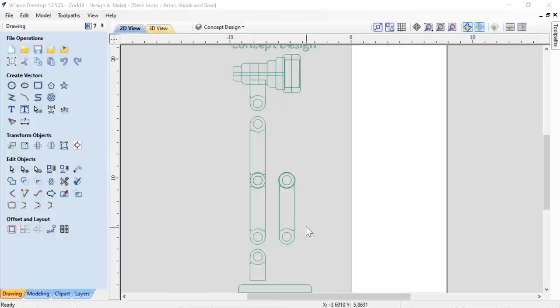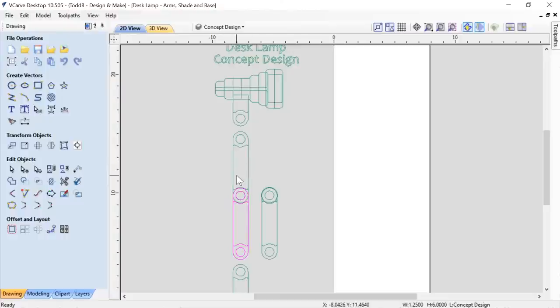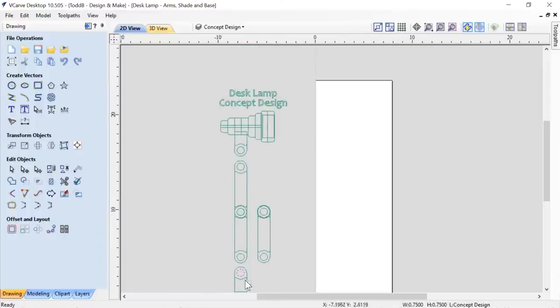So here's the armature. Look at the armature first. You have the actual armature that fits together here. These are just grouped together. There's the two middle parts, which are 6 inches long by 1.25 inches wide. And then you have these two end bits here that are the same. They're just one of these armature bits cut in half. So you get half at the top and half at the bottom.